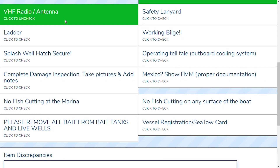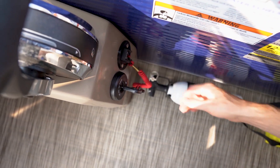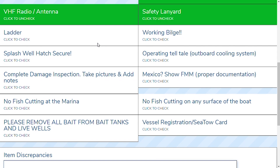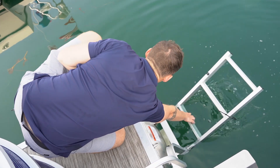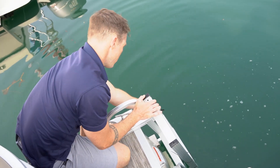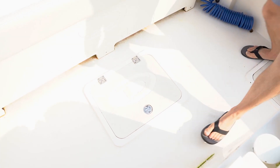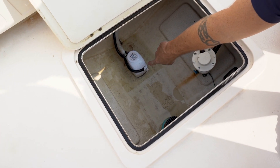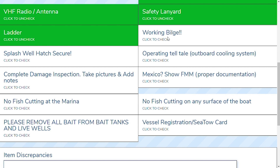Next is the safety lanyard. The safety lanyard is extremely important — it's the kill switch for the boat. If you're having trouble starting your boat, a common error is the safety lanyard being detached, so double check that. Next, let's move on to the ladder. It's very important to make sure your ladder is secure before you leave the dock, and check it again any time you use it during the day. Let's move on to the bilge. Every boat needs a working bilge except for certain pontoon boats. Make sure to turn the bilge on and listen for its function — if the boat is taking on water, it's the only way to evacuate that water.